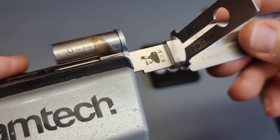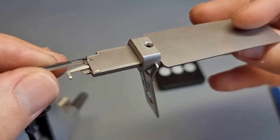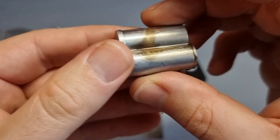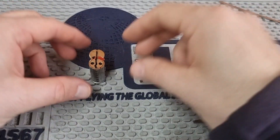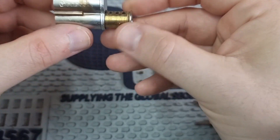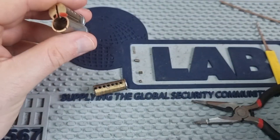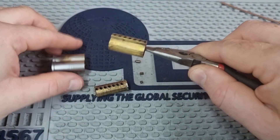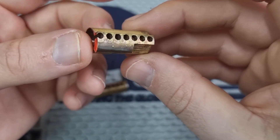You're going to be setting that first key pin rather than the second lot — that would seem to make sense. So let's cut this thing open and actually see what's going on. There it is — that is pin seven, the seventh pin stack. I took the back off and the actuator — that's your plug, your main plug so to speak. If I just nudge that out, there's your secret second SFIC bible. I've colored that in red for the cross-section you'll see in a minute.